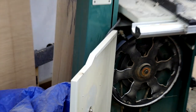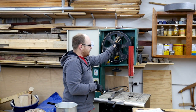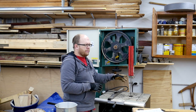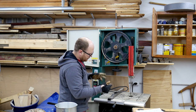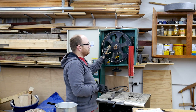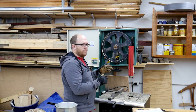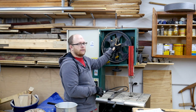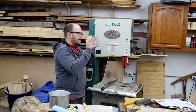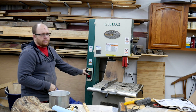Now I've got to put the blade on. I just installed the blade and everything is turning smoothly. There's a little bit of rubbing, but that's just on the blade guides — I've got to adjust all my blade guides, get the tension right. Once I'm comfortable that everything is adjusted properly and the blade is tracking the right way and won't come flying off, I'll bump the motor and see how well this thing fires up. I've got everything tensioned up and tracking properly, and I've pulled the guide bearings away from the blade. Wish me luck.